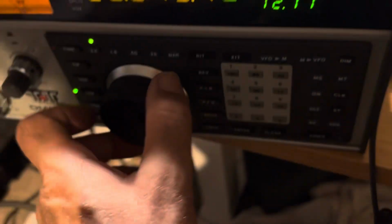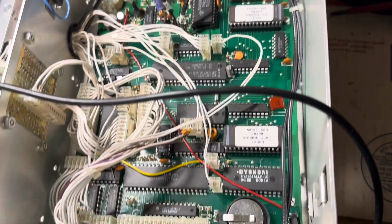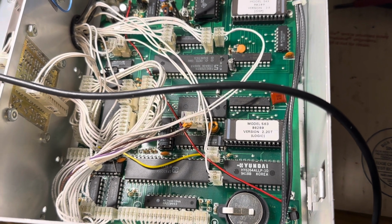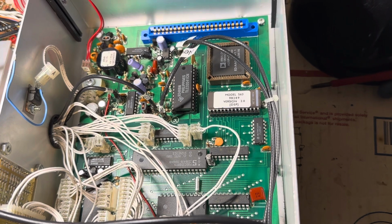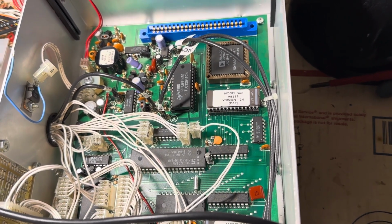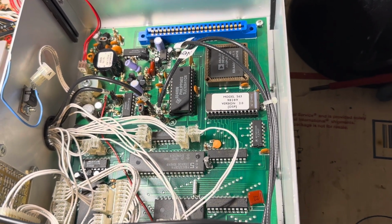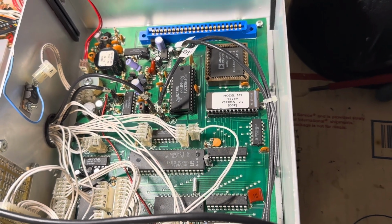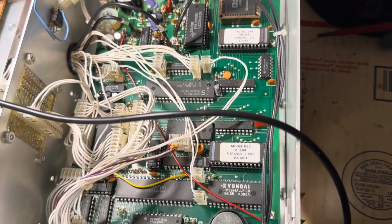And let's see, it's still working. Yep, there were a couple of fishy solder joints under there. Just didn't look too good. Anyway, I'm desperate here. Didn't know what to really do. The thing's locking up every so often, so I pretty much resoldered half of the solder joints on the bottom of this card, including all the ones that look fishy. A couple were missing some solder, not many, but it just takes one to cause issues. So I probably hit half the joints on this thing.